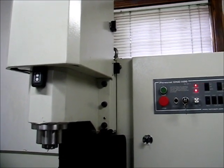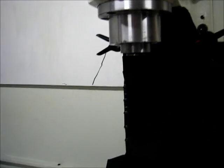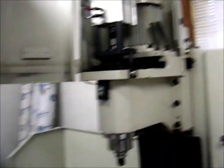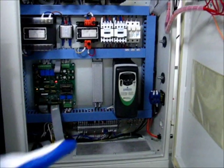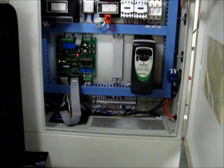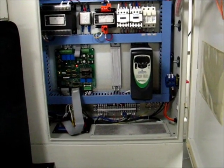The brake that normally stops the motor from turning doesn't actuate when you do this, so I'm still staying on the pedal. The fix, which I haven't tried yet, is apparently to connect what amounts to a phone cable from the VFD interconnect outlet on this power drawbar control module down to the VFD. The VFD itself doesn't have a phone cord style connection — which would be RJ11 — but it does have ports for you to connect the wires to, which is what I'll be doing next.